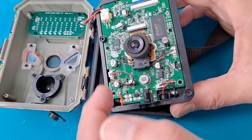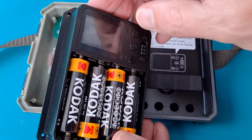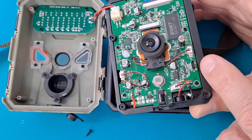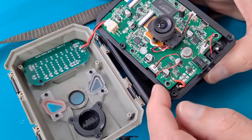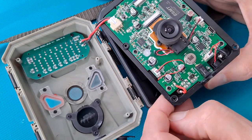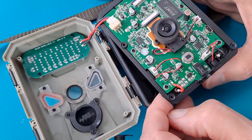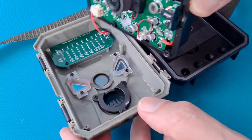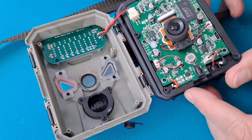So that's what it looks like inside. I'm not going to take that out. What's going to be on the other side? That screen and those buttons. I am intrigued by that USB there though. So I just think that's for programming it. Over here, we've got 4 pins: ground, receive, transmit, and 3.3 volts. So I would guess you can upgrade the software. Okay, can we get that back in? Oh, I was going to wipe that lens, wasn't I? I suppose I should have gone macro mode to show you the fingerprint, but I've wiped it off now.